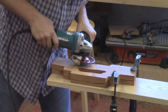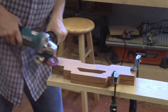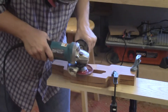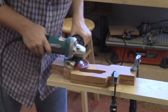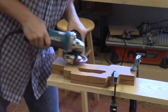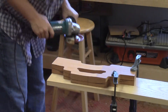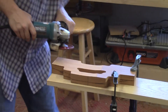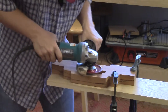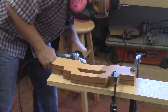As I continue to do this, I check my lines, and as importantly, I'm making sure I take even amounts from both the top and the bottom. Here I'm checking my lines and making sure I'm close, then I'll start in and carve more from the actual other side in. Checking my lines once again — I just want to continue to work back to these lines. They are the rules here, they're boundaries. You don't want to carve below any of the lines; instead, you want to carve right up to the black lines themselves.